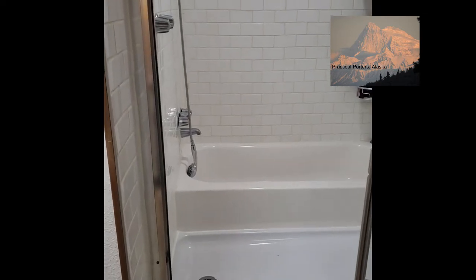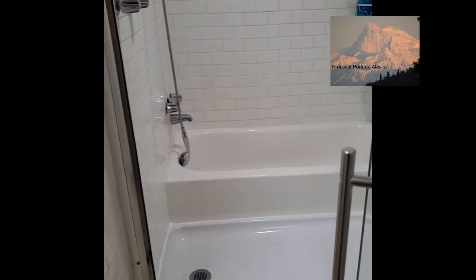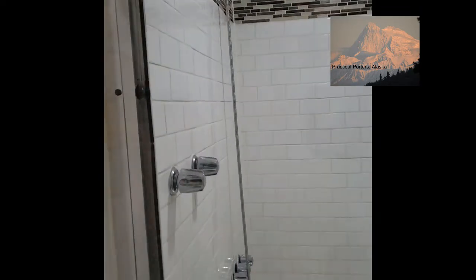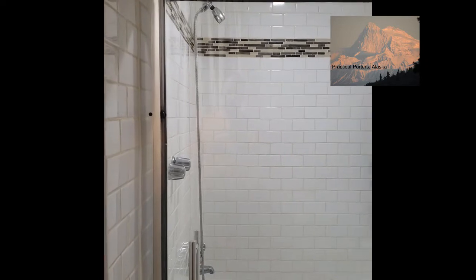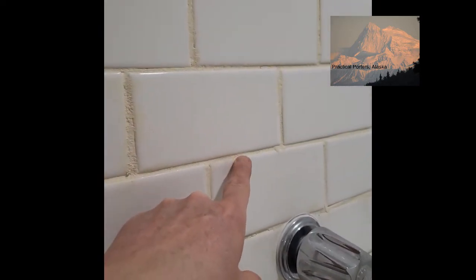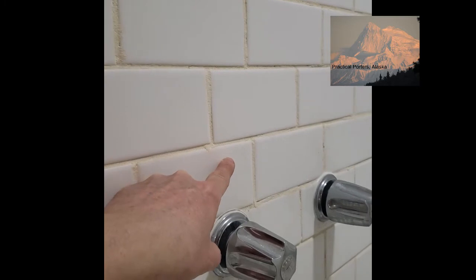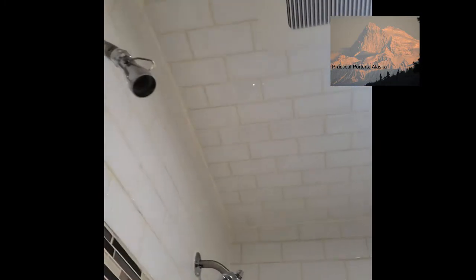This was a really interesting design that I got to help out with for a bathroom, shower, and tub that was enclosed. When you shut the door, you have kind of a sealed sauna room. For that reason, they used waterproof, flexible epoxy grout, which was a huge pain to deal with, but it really prevented massive amounts of mold.